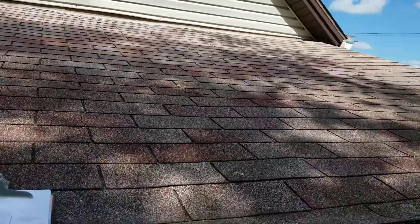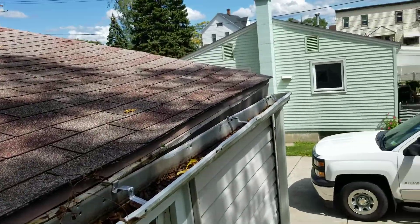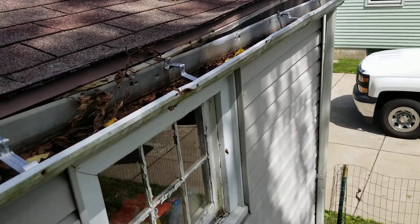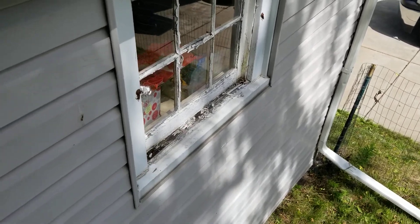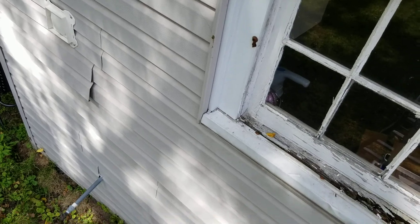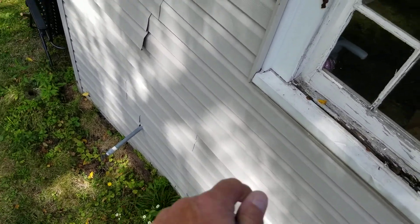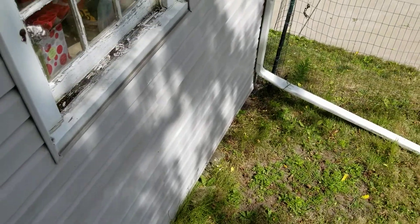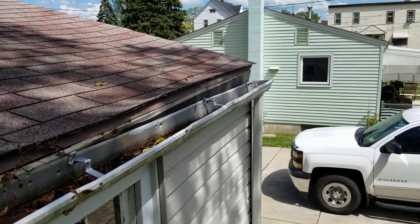At minimum, the bottom four feet comes out — maybe extend the rafters in the overhang and reconstruct this section. I need to see what's on the inside first. The rear walls could be rebuilt, windows come out, and we should make some provisions for a future side glass door. Also need to find out what's going on with this plumbing stack, and I suspect the foundation is pretty poor here too.